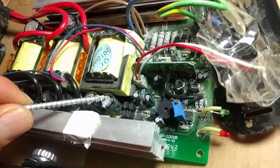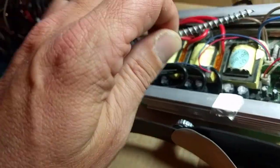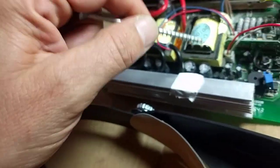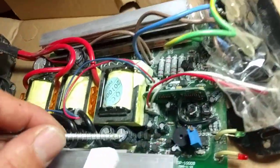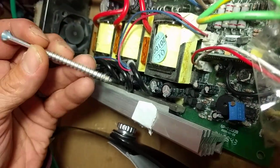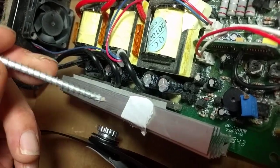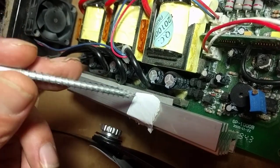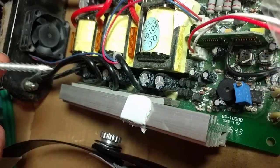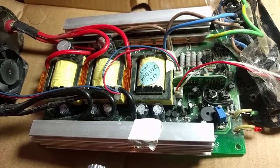You want to check the input caps just to make sure they are 25 volts rated, which they usually are. If they're 16 volt rated, then it's pretty marginal. The only other part subject to input voltage changes are the switching FETs, which are the low side switches — these are going to be rated significantly higher than you care about, probably 30 volts or so. So going from lead acid battery voltage to LiPo voltage is generally fine. And there you go — the LiPo modified inverter.